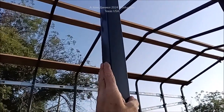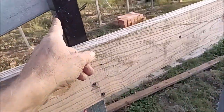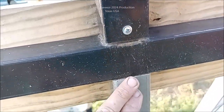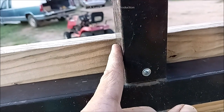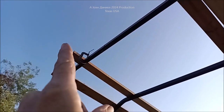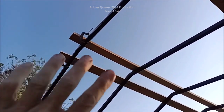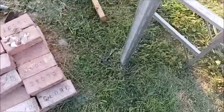I do a lot of these aero frames where I extend them — I put a pipe in the ground and extend them. I haven't welded this yet but that's what it looks like. I shortened it from a 27-foot frame down to 19 foot 4. That allows me to have overhang of the metal with 20-foot two-by-sixes, which you can buy for about 16 to 18 bucks a piece. That way I built a building that can handle solar, with closed-cell inch-and-a-half foam in between for insulation.